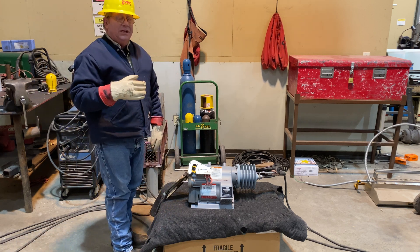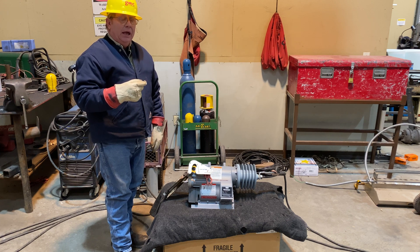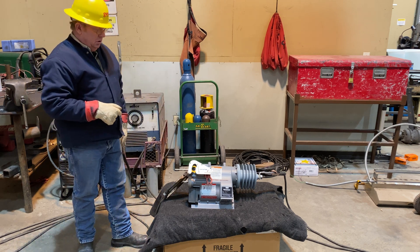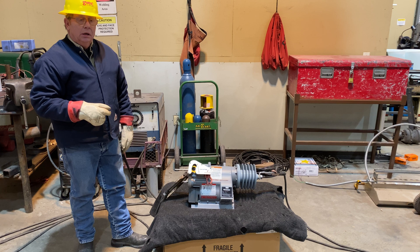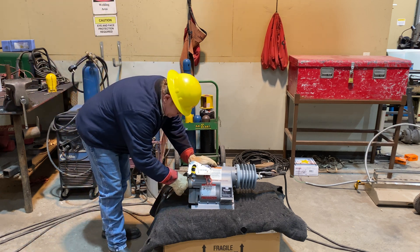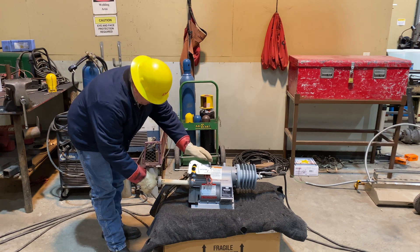We're going to do some battery maintenance on our Versatec system — removing the old battery and installing a new one. All of that can be done with a stick. I'm going to use my rubber-gloved hands here, but it can be done with a stick while the device is energized and nothing will happen. We remove the battery — the breaker did not open, the breaker did not operate. We put the new battery back in — the breaker did not open.